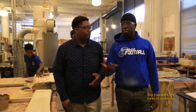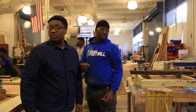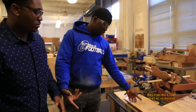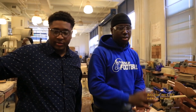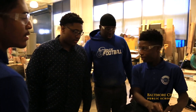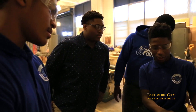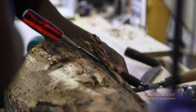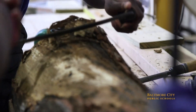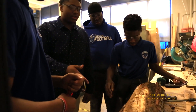So what's the next step? We are going to pull the bark off because we were sanding. If there's any leftover bark, we're going to use the tools to get the bark off. This is what it actually looks like once you're done — using a 40 grit, 100 grit, then 220 grit to make it real smooth. We're taking the bark off using a chisel, a spokeshave, a hammer or a hatchet — you can use plenty of tools to get the bark off. The spokeshave, you put it and it skims across the top to get that bark so you get to the good wood. The good wood is the light part that you start to see coming up. Once you get the bark off, you go and sand it.